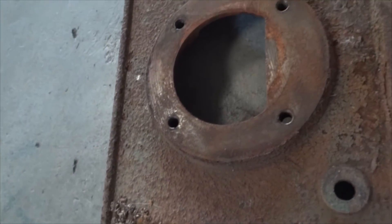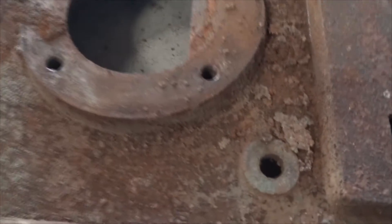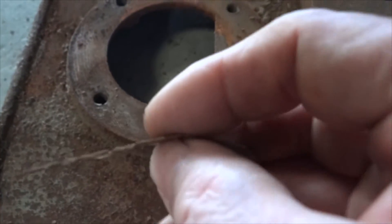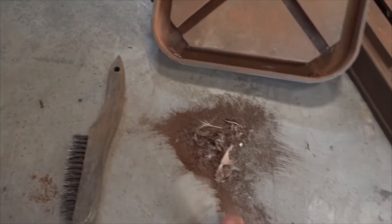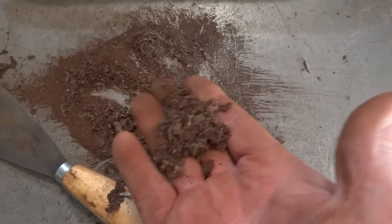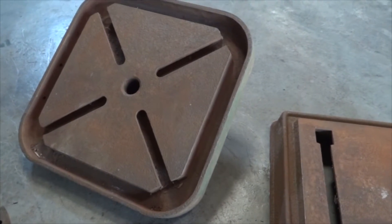After scraping, I'm going to put it in the electrolysis tank that I'm making over here — this is going to be the tank. Look at how heavily this rust is here when I scraped it off. This is a piece of rust, and I spent about 10 minutes here scraping with the scraper and wire brush. Look at the amount of loose surface rust I got off this cast iron — quite a bit.